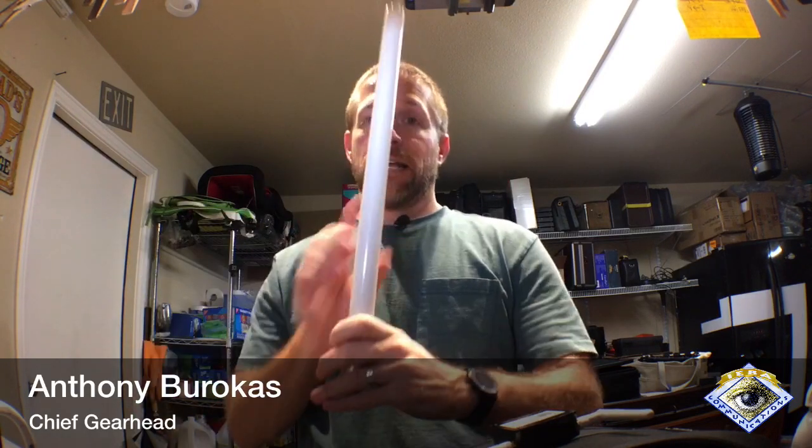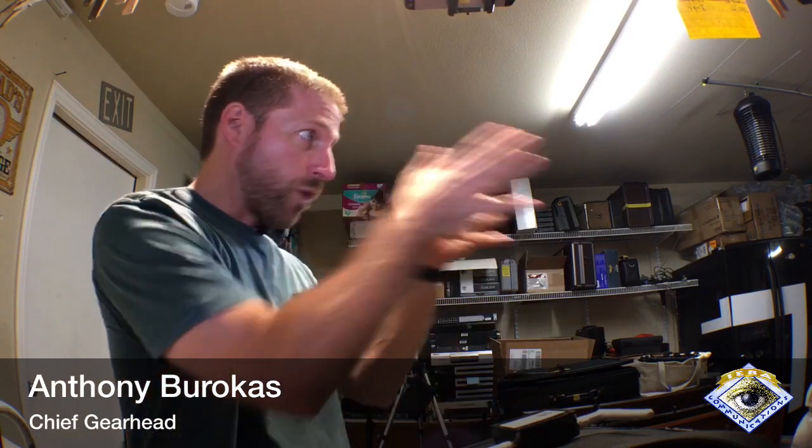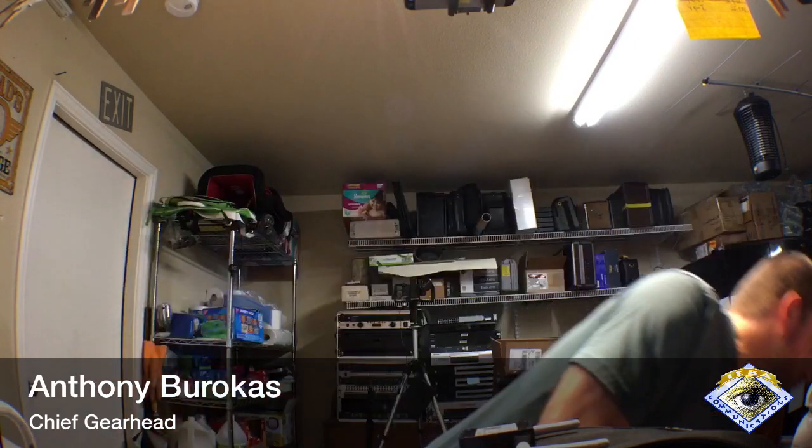You can also get directional antennas which will, like a parabolic dish, focus all the energy that would normally radiate in all directions and direct it all in one direction. They can have upwards of 20 dB of gain, which is a huge amount. If you find yourself situated towards one end of an event field or something like that, and all your devices that you need to talk to are in that direction, a flat patch antenna or a directional antenna — like this one I happen to have here — would be ideal.